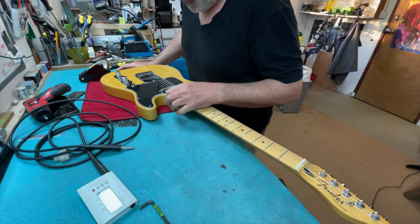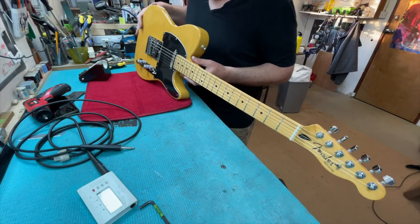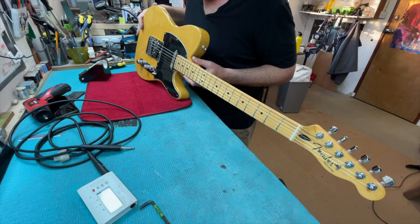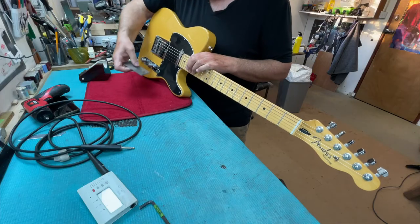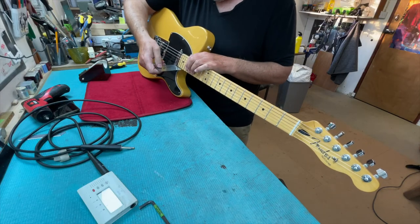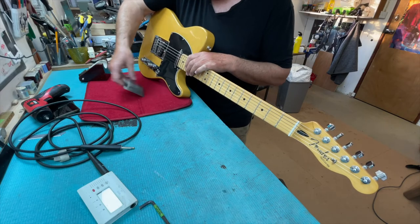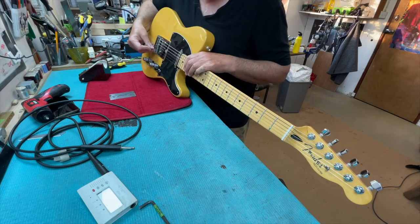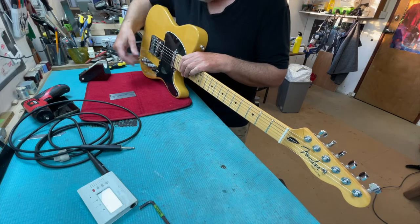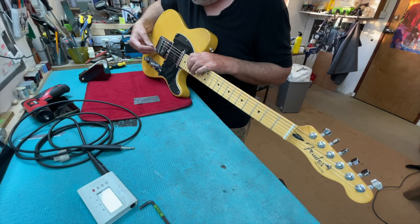And so all of that accuracy is a complete red herring or a waste of time. It's just for people who insist on being able to say it's that accurate. So I'm just going to double check all of these again now, because we've moved a couple of bits around. We're slightly under the height here. It's almost a bit too low, which makes me nervous because I like getting things very low, but it doesn't give any leeway for the neck straightening out in transit or in a different environment, and so forth.